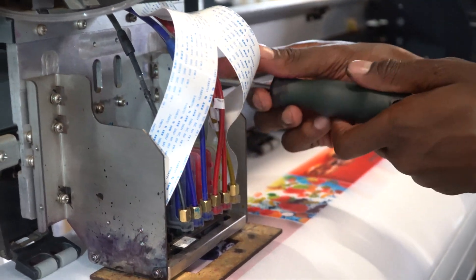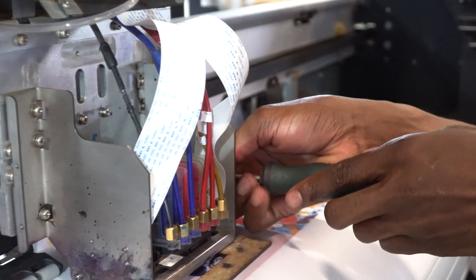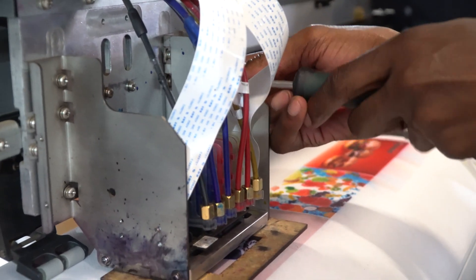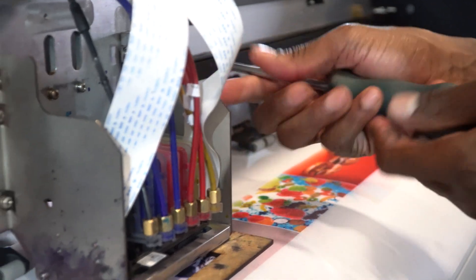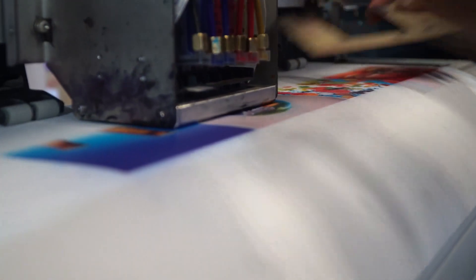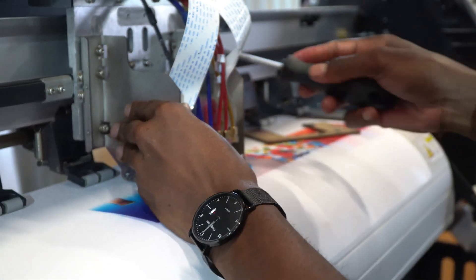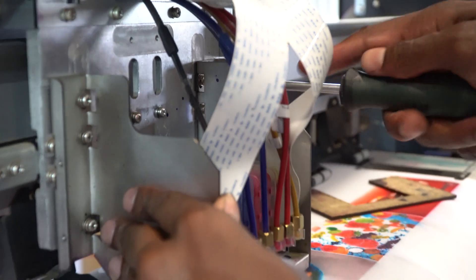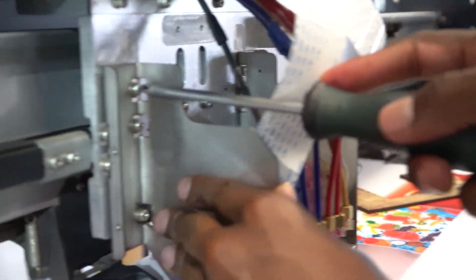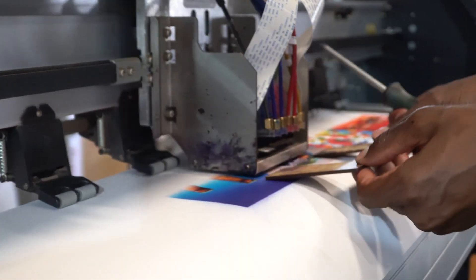I am now able to move my head up and down. On different machines people adjust this differently, but on these models that we supply you manually have to adjust it. I'm going to push it down until it sits on the wedge — about three millimeters — but on this model I found that could still be a lot, so I'm pushing it down a bit more until I have good clearance. Then I tighten it. On this specific model, I tighten it until I can no longer fit the wedge.